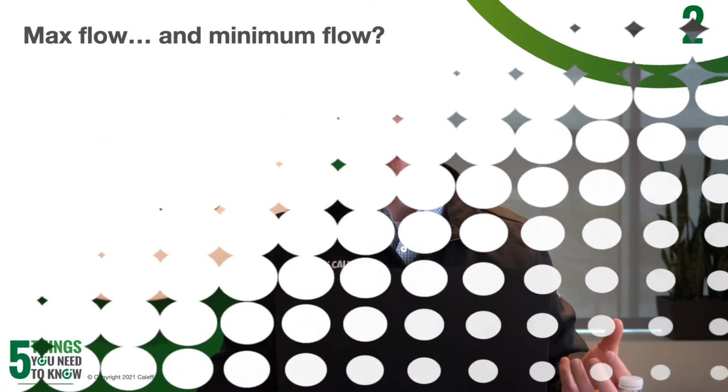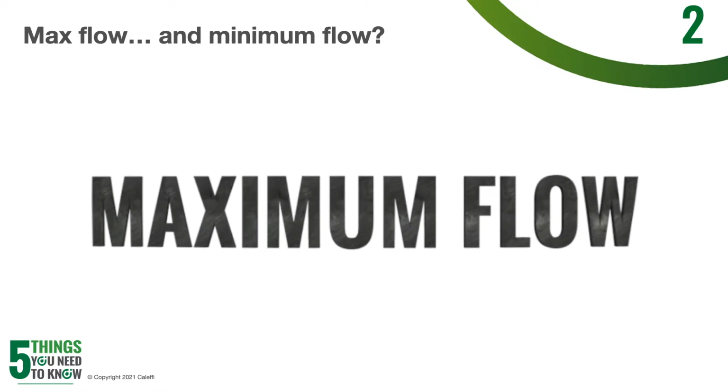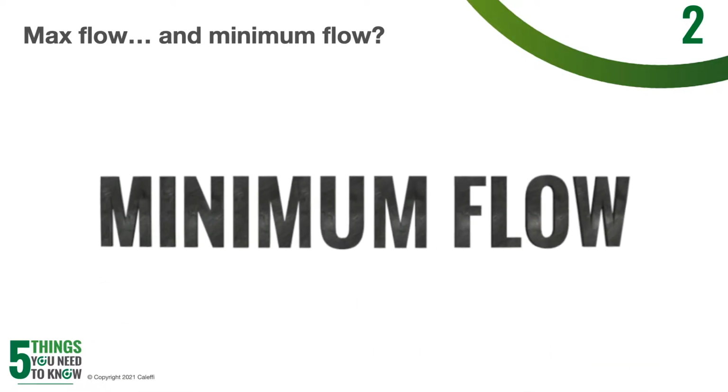going to have maximum and minimum flow rates that you need to be aware of when selecting the proper model. Exceeding maximum flow rates could create a large pressure drop or a loss of pressure in your system, but not meeting the minimum flow rates can cause temperature differences or inconsistent temperature control. In applications with larger flow rates, larger minimum flow requirements may need to be met.